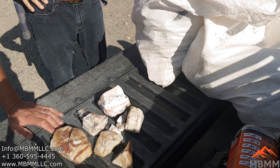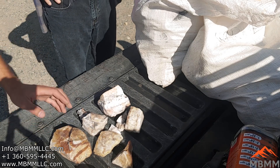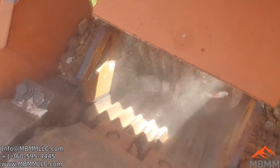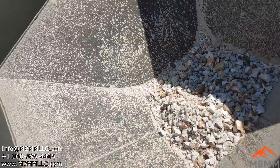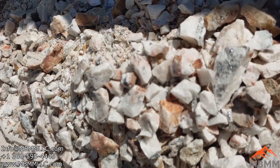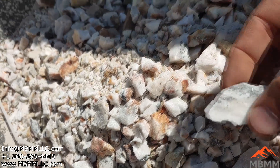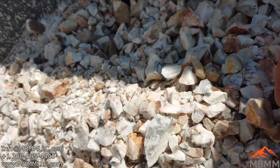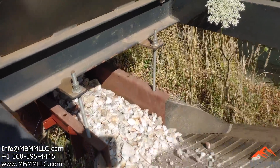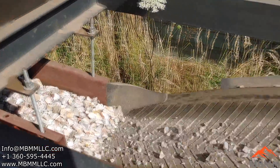Was it just gold they were after, or did they go after the galena and the lead or silver too? It was primarily gold. There is a little bit of silver associated with the galena, but not enough to recover. That makes the ore quite simple — it's free milling for the gold, and that's the best part. The free milling gold means you can just crush it and get it out. If you can keep it simple like that, just crush it and recover the gold fraction by gravity, just like they did at first. We were talking earlier about using a little hammer mill and sluice — go up there, do some testing, and if you can prove it up.